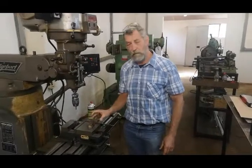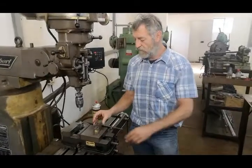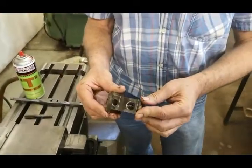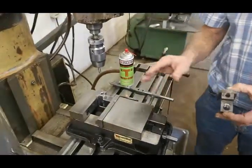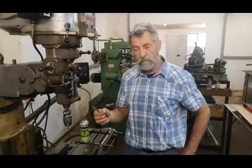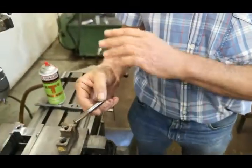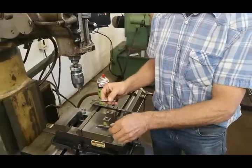Here I'm going to do a little tapping demonstration on an actual part — a high precision vice that's broken and irreplaceable. I'm going to do a full restoration. I'm not sure how the steel is going to behave, so I've brought along a little progressive tap, similar to the series taps — starts with almost zero thread to full form. Plus I've got my spiral point tap, because this is really serious steel.